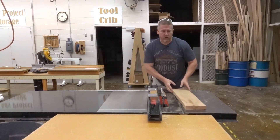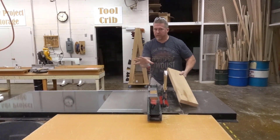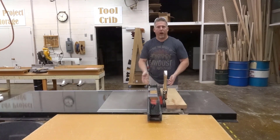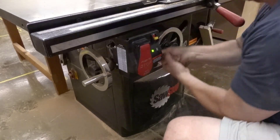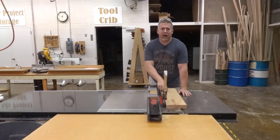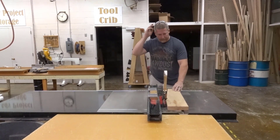Always make sure — because this wood is a little extra thick — you raise the guard with the blade stopped, of course. Set the board next to the blade and make sure the blade is high enough to cut through it. Our other lumber, which is thinner, doesn't need the blade as high. You're going to be turning the handle right in front of your knees on the front of the table saw. Turn it clockwise to raise the blade until the gullets — that's the dip between the teeth — are just above the board, so the teeth protrude out the top. Once you have that set, turn it on and let's cut a couple of strips.